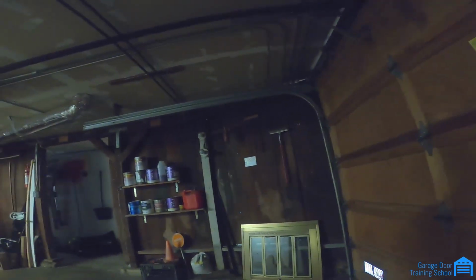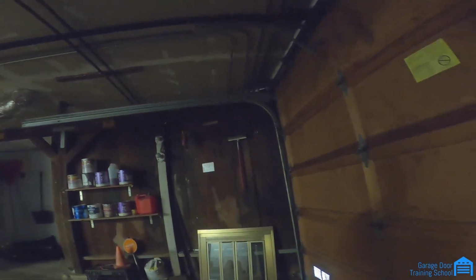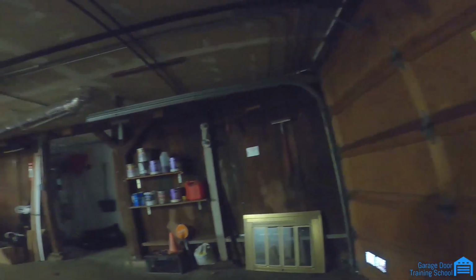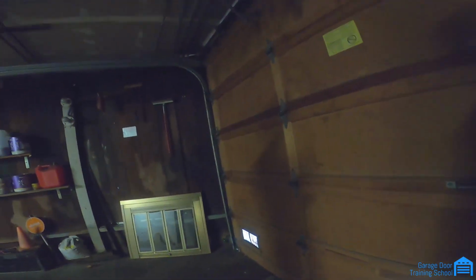Wow. So you have to use this track. You can't frame it down to here because you'd have to duck to get in. But you have the room still. You can frame it down to 7 feet on this door, and it will still be a standard height. And then you'd have a ton of room. You can use regular track, and you can mount the opener to the header, and it would all work perfectly. But I can tell you right now, this door doesn't work smoothly if you were to use it by hand. You can tell that this thing doesn't work that smoothly.